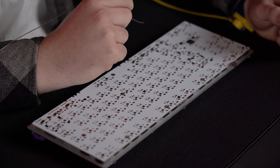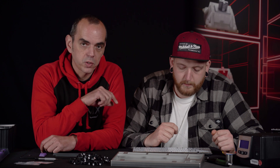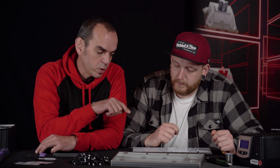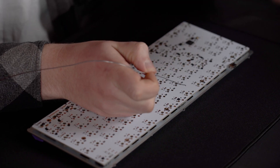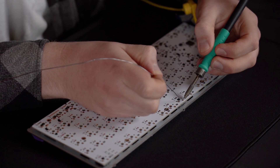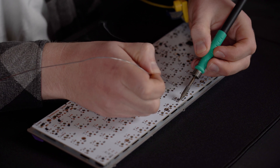Now we start the actual soldering process. We're going to solder the switches used for the adjustment in the first step, so you don't have to assemble all the switches right away. Just place a few switches on the corners and on the bottom row so the PCB is nicely adjusted. When you assemble the first switches, press down the PCB so there is no spacing between the switch and the PCB — otherwise you will have trouble with later switches. Heat up the switch, clean your soldering equipment, heat the switch a little bit, then solder it for about two or three seconds. Then clean your equipment again and continue assembling all the switches in a row.